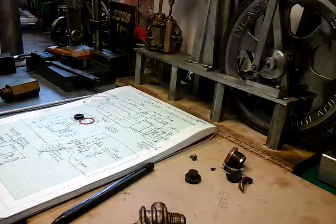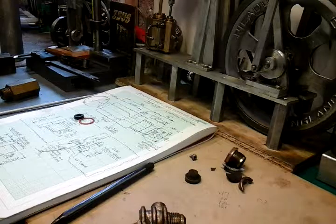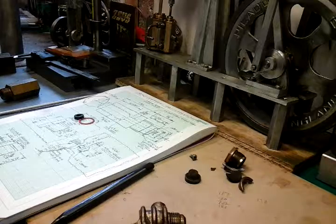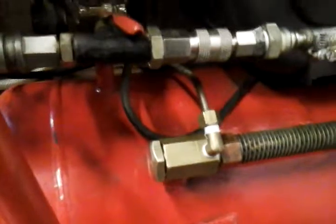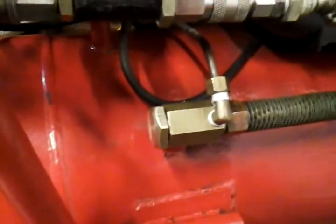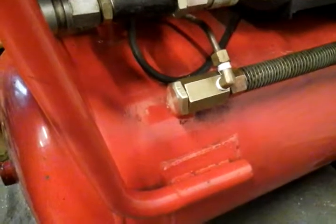Just before I leave you, I've got the valve fitted now to the compressor - I'll just show you that. I've pumped it up to full pressure and it seems to be working fine. So that's just an upgrade for you then - if you want to have a check at your own compressors to make sure you haven't got a similar valve system to what I had, which failed. What I've done is just gone over the joints with a bit of washing-up liquid to make sure they're all sealing okay, and yeah they're fine. I'm happy with that. I've shown you the drawing, so that's everything I think. Thanks for watching.